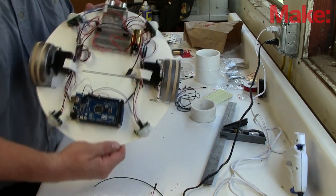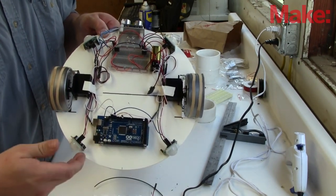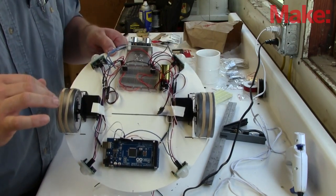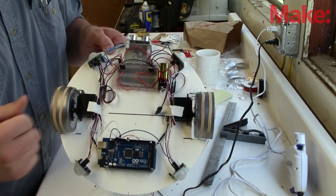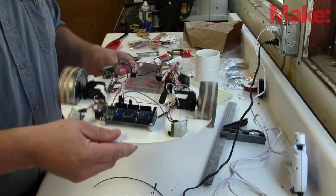I also did some wiring. I added some sensors and the Mega. Here are some PIR, or passive infrared motion sensors, and a ping sensor, which I'm not going to use right now, and our servo motors. On the wheels, I added some rubber bands for traction. There's a breadboard here with two 5-volt regulators on it, and the board now has a 9-volt battery for power to the system.